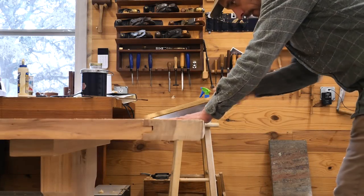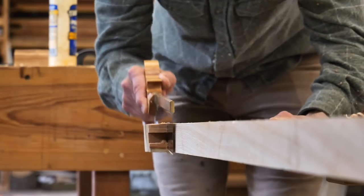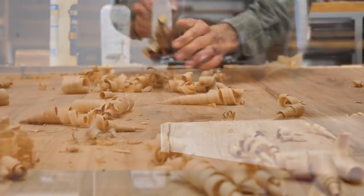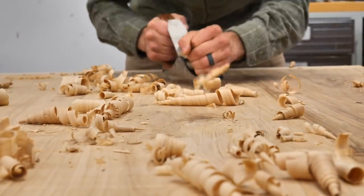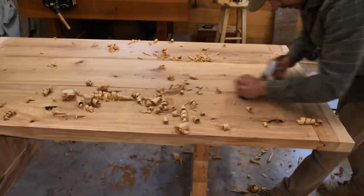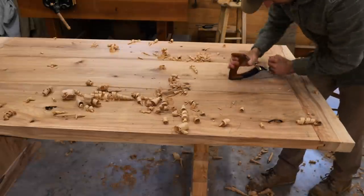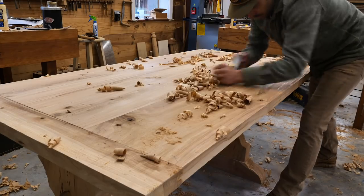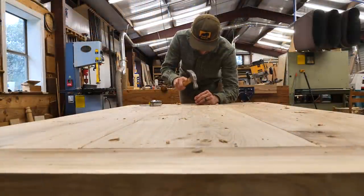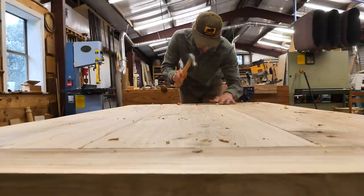So I went through the whole process of building the tabletop without filming much of that — not super exciting — and I jumped on the machines because I was a little behind. I did do breadboard ends; if you want to see how to do breadboard ends I have a really good video on that alone, I'll put that link in the description. The entire top of this table is hand planed. I used a scrub plane so it's got a little bit of shape to the blade putting some texture in that tabletop, getting some tear out in some places, just adding a lot of character. Obviously a tabletop in the first century would have been hand planed so I wanted to kind of match that vibe and feel. It's a three-board top — not glued up — each board independently floats in a tongue and groove with the breadboard end locking each board together, so there's room for movement.